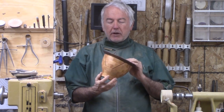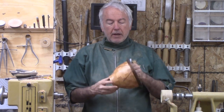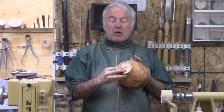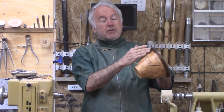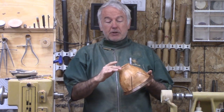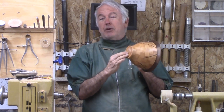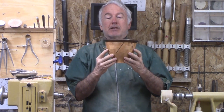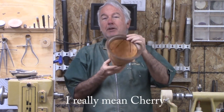It's something I wanted to try. I've not seen it before, and it actually shows on the inside and outside but has a definite stop at a ring. One other thing of note is that the base here looks like it is solid. However, it is inset into a segmented ring to preserve the appearance of segmentation all the way up. Since solid rings can also be a problem with expansion and contraction, this is actually a self-made plywood lamination so that it controls the expansion and can be safely put into a segmented vessel. So, let's make this segmented apricot and walnut bowl.